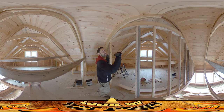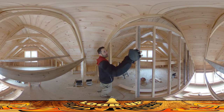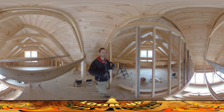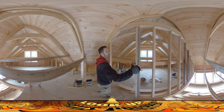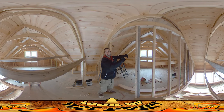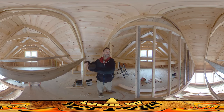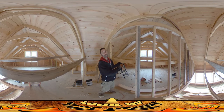Things are going pretty well up here. Once I get this wall sheathed, the sheathing is going to hold this wall together — drywall doesn't have that much shear strength, but the wall boards here are a very strong structural element. So once I get the wall boards attached to this, I can remove all of these little things we've been hitting our heads on the entire time in this area. The rest of the area I'm going to have to leave them up until I do more structural stuff over there, but at least for this one room we'll be able to remove them.